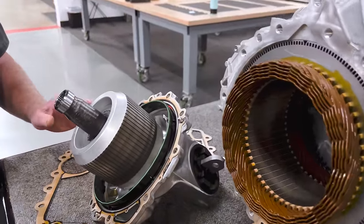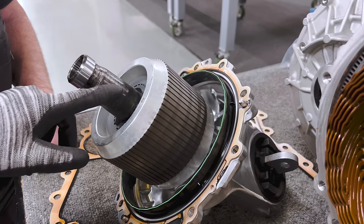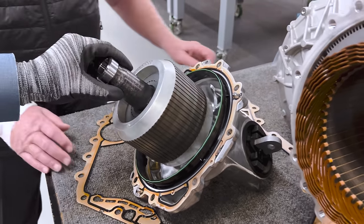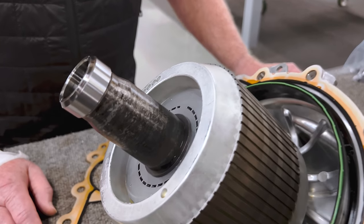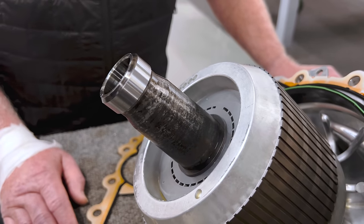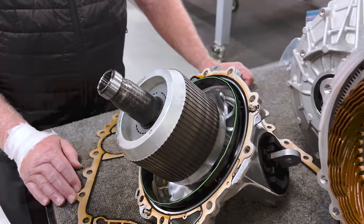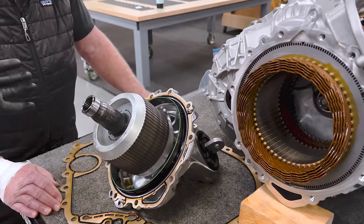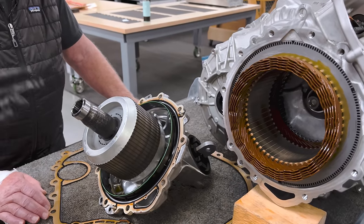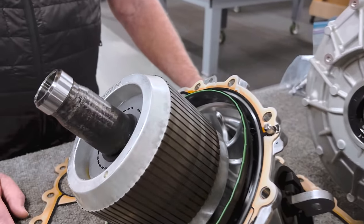One thing I want to point out — and you can see it in our report — this shaft is a new thing for Tesla and new in the industry. It looks kind of dirty because it's cold-headed to near net shape, so they can reduce the machining needed on the shaft. You can't make a great motor without a great shaft, and having a way to do that less expensively is a big deal. Tesla has made a big move here on this shaft.